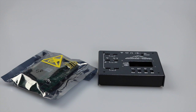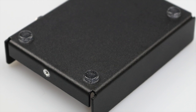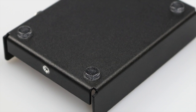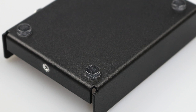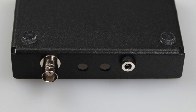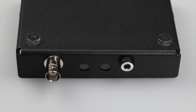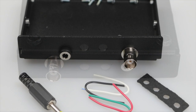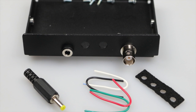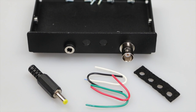The first thing I did was stick the self-adhesive feet to the bottom of the case — done by eye, but if you're detail-oriented you may want to create a guide, as once they're stuck there's no going back. I added the BNC socket and the power socket. Note that the BNC and the hole it goes in are shaped — the hole has one flat edge to help prevent the socket rotating when twisting plugs in and out. There's a solder tag on the inside and the paint has been removed from around the aerial socket position, so make sure this is clean for a good earth connection.